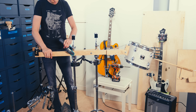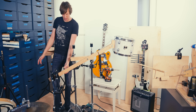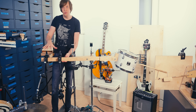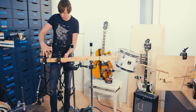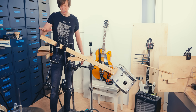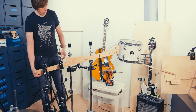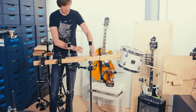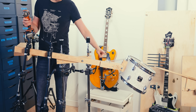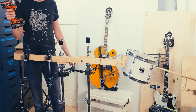The pivot seems to be ready and I'm using a counterweight to balance the entire contraption. Right now this side is too heavy, but I don't need to reduce these weights — I can just move them closer to the center, which will reduce their leverage on this lever. Now the drum is heavier; I just move them closer to the pivot. I actually want them to go that way, because then when we put a stop here — oh wow, beautiful. I want the drum to return to exactly the same height every time, so I'm putting a stop here. There we go.